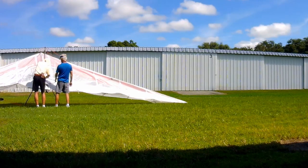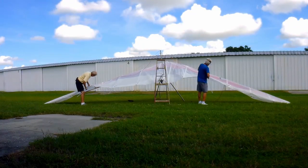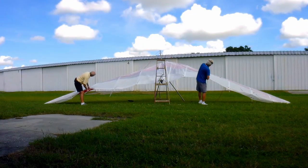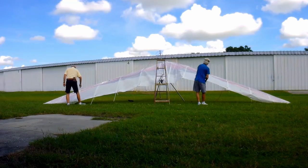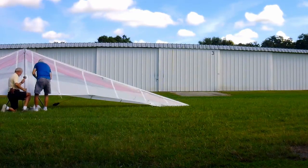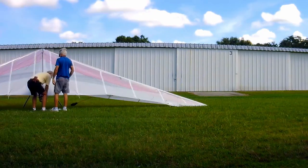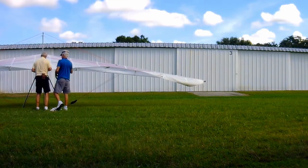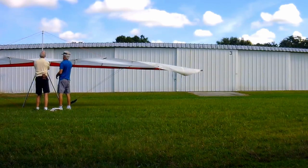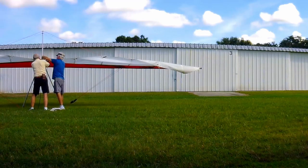This is an older wing and still sports a king post. The king post supports the wires that hold the wing up while it's not in flight. Otherwise, the wing would collapse on the ground without an airflow to support it. Newer wings are strut braced, have less drag, and reduce the aircraft's height by 3.5 feet. Nevertheless, this wing will do superbly, although the aircraft will have to be kneeled before it will slide into the 9-foot, 4-inch-tall hangar door.